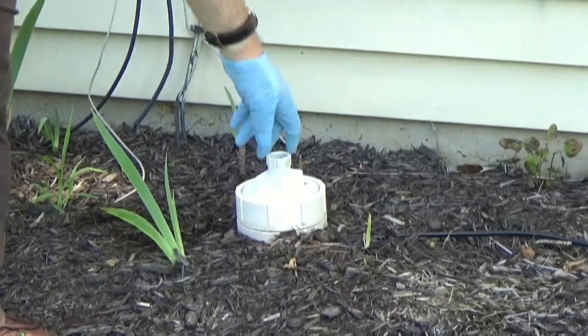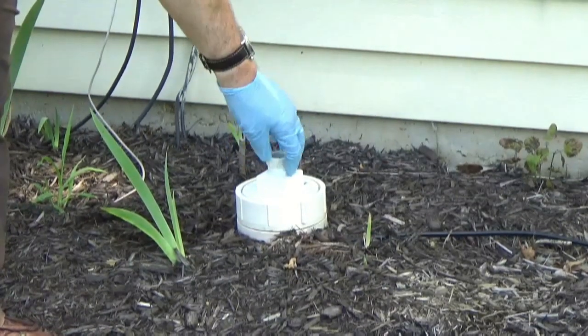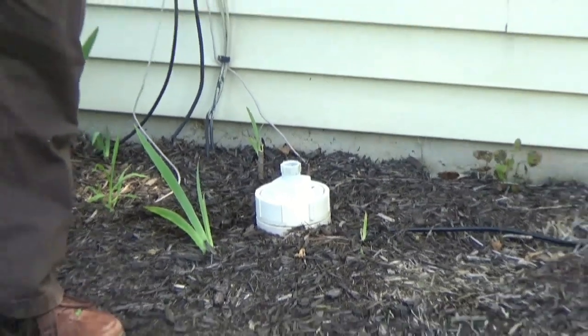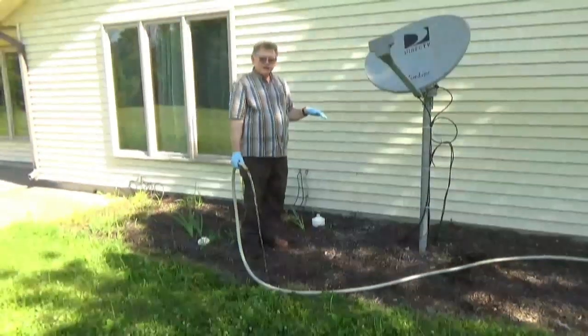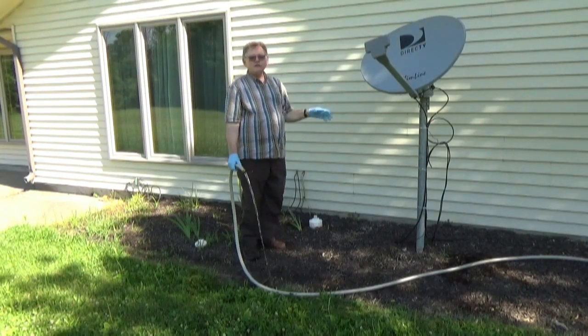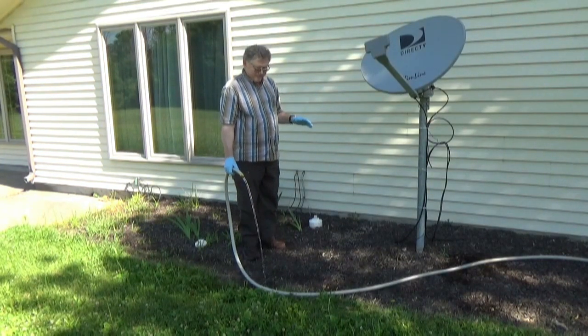You can see what I've done here — I've hooked up a garden hose outlet to my clean-out for my septic tank. Like I said before, as long as you're within about a seven-foot elevation change, you can run right into your septic tank or into any drain in your house. Do not go into a city storm drain — that's a bad idea.